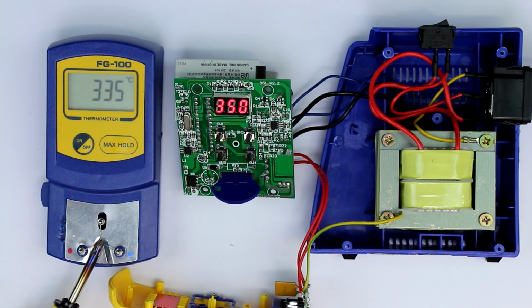So it looks like here we are still in the range of 15 degrees low. It looks like they have calibrated this thing at 450 degrees Celsius. And let's say that this is 15 degrees too low. So either there's something wrong with the circuitry or with the calibration or with both. So we're nearly here also 20 degrees low, between 20 and 15 degrees. Before we go to the circuit analysis of the analog part, how they measure the temperature and what's perhaps wrong with that, let's test 2 other safety features.